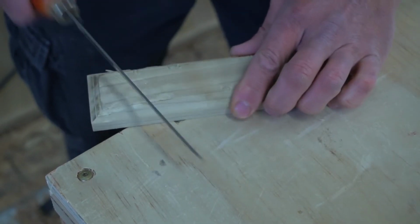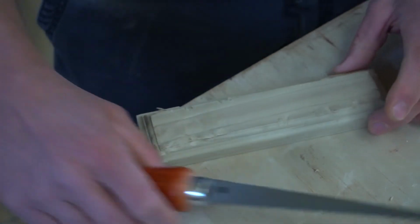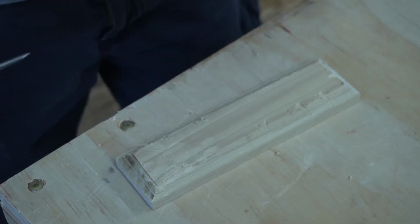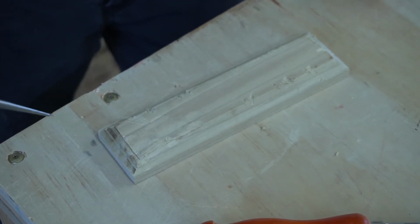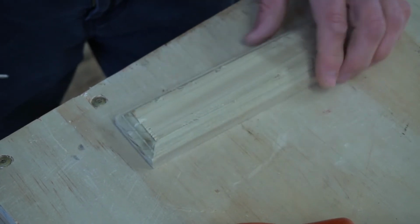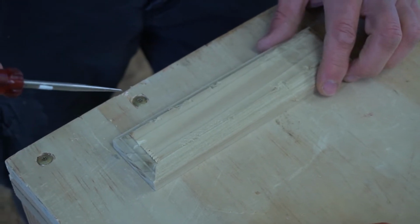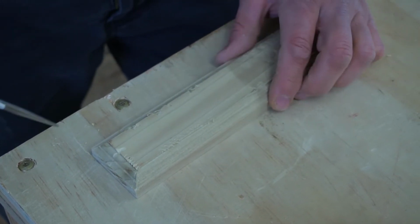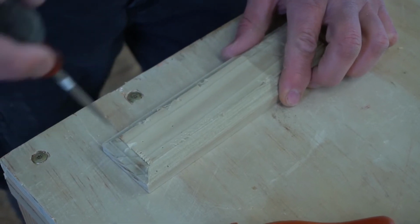And it's okay to come through here too. Like I said, it's the best part about distressing. It's however you want to do it. The next tool I like to use is the awl, and this thing's really versatile. A lot of really old pieces of wood, depending on where it's from, will have wormholes in it. A wormhole is simply a little bug that got into a tree when it was alive and started eating on it, and they leave these little teeny holes, and this tool is perfect to make that resemble these wormholes you see in nature.